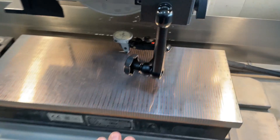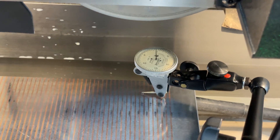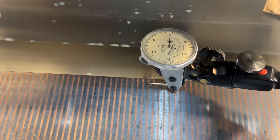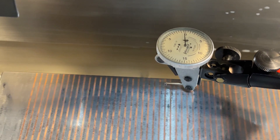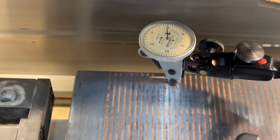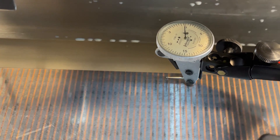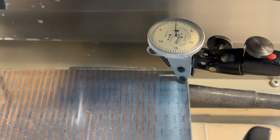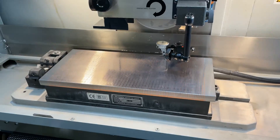This was very interesting — I didn't expect it to be as good as it is. And if I get to that back edge, let's just see what the back edge does here. It's not clear if this is wear or if this was from the original chuck grind, because when we get to the ends, it is still a little low. Maybe the original chuck grind is rearing its ugly head. I don't think that's wear — I think that was the original chuck grind.